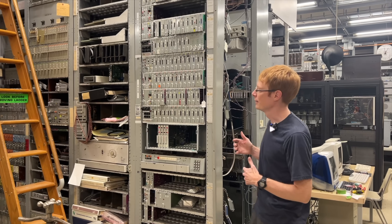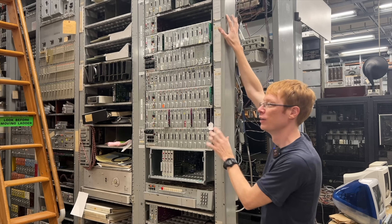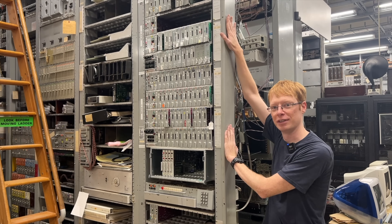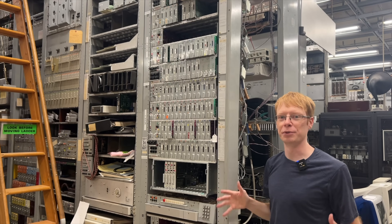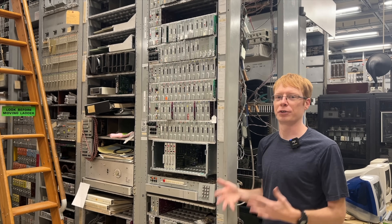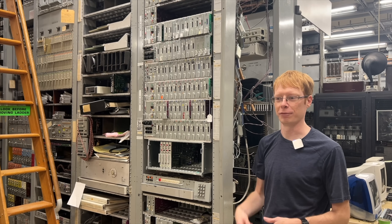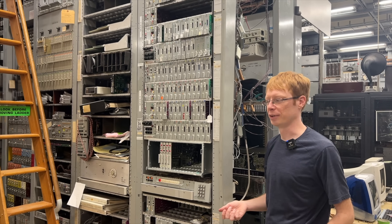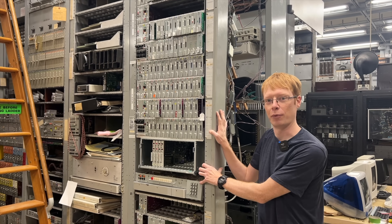Part of that story is that we need to use more of the D4 bank. The D4 bank is a piece of transmission gear, and its job is to change analog lines into digital T1s — that's its only job. The Bell System used it extensively so that they could get more trunks going from office to office using less cable, not having to run a single pair for every trunk, but instead putting many trunks onto digital T-carrier and cutting down on the amount of outside plant wiring needed.